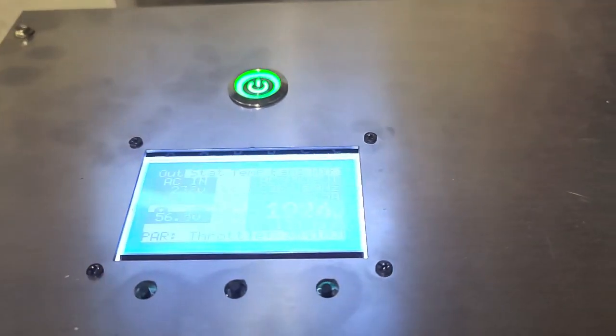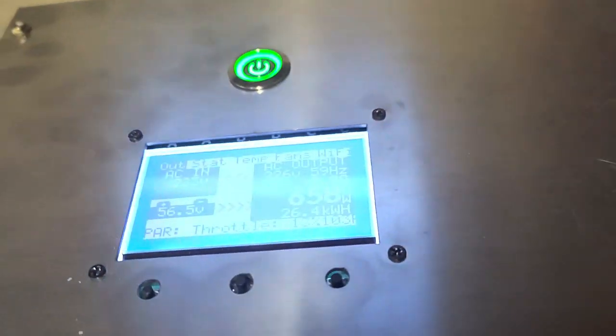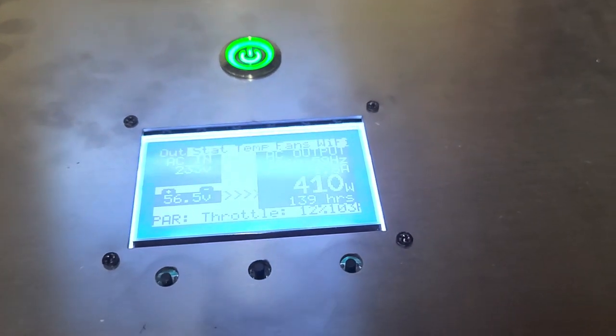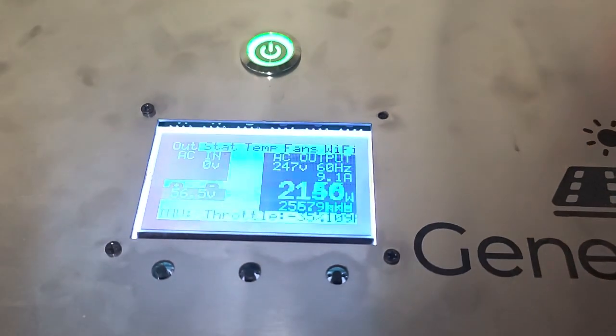Here it is, 9 in the morning, so I don't have any solar coming in basically right now, so the AC unit is definitely consuming my battery. You can see here the slave kind of kicked down a little bit — it's less than a kilowatt, whereas the master is still running 2 kilowatts. But this is not accurate. As SID pointed out, it's the throttle number that's the important thing, and that's what we're tweaking to get a perfect 50/50.